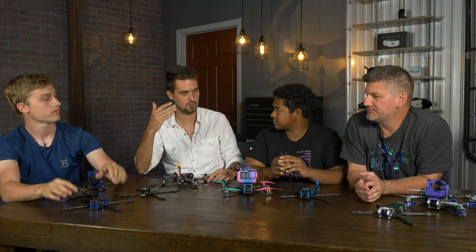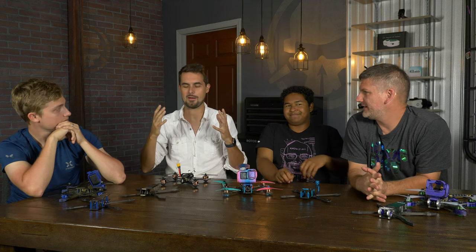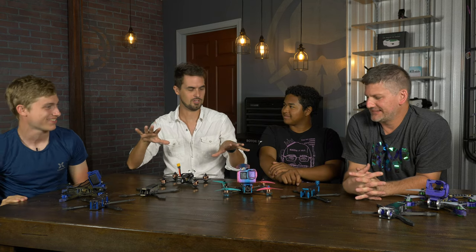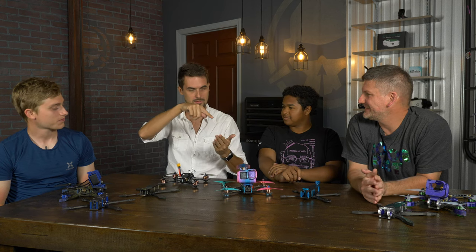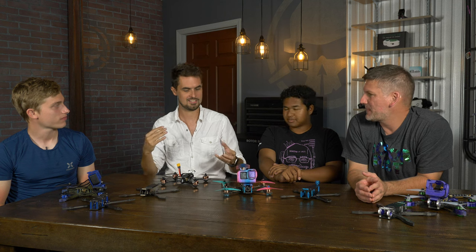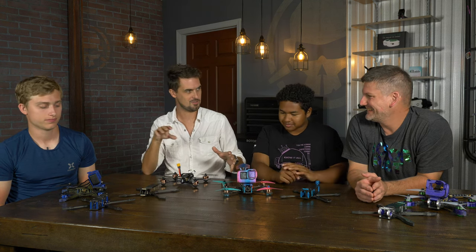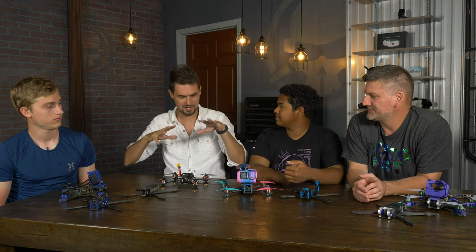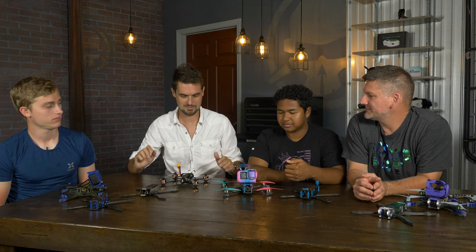At least it's not like those old school frames that had all these cuts. It's like people were looking at carbon fiber the wrong way. And this was the really early version, very early versions of drone frames. So no hate, all love. But they had truss shapes cut out of them. And it's like, this isn't aluminum. You don't want to cut carbon fiber into a truss shape. You want a nice, even sheet. You want lots of the weave going on. You want lots of interlacing strands of carbon fiber.